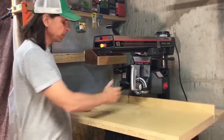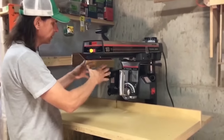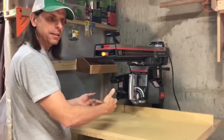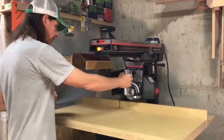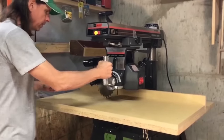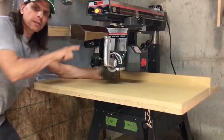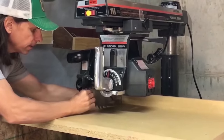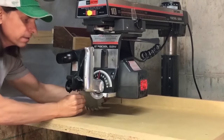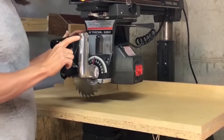There's a safety concern with doing pull-through cuts. The blade has a tendency — naturally spinning this way — to run towards the user. Here I've got the blade just barely touching the table. If I spin it in the same rotation as when the motor is on, you'll see that as it grabs, it runs towards the user. This saw spins at 3,450 revolutions per minute.